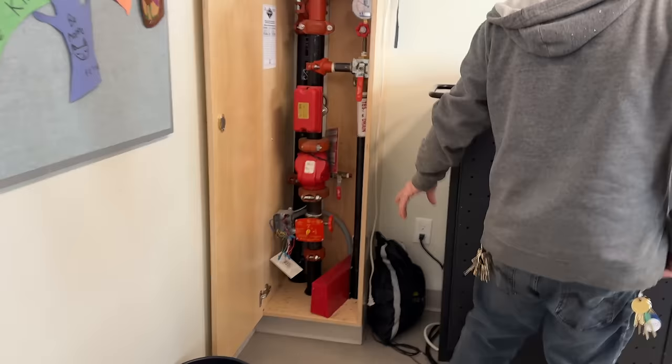I've dealt with these before. This isn't my first time I've seen these XP6 CAs, I believe is a model with the Sync 1As that don't work properly. They definitely don't follow a synchronization output from a panel, but they should still follow each other's sync. That's literally what they're supposed to do. And a booster panel can follow their sync. It's just them that have the problem. They can't follow a panel's sync, which, like, fine, whatever, but it should still follow each other's sync and they're not. And technical support said that this happens often and there's not really a fix.